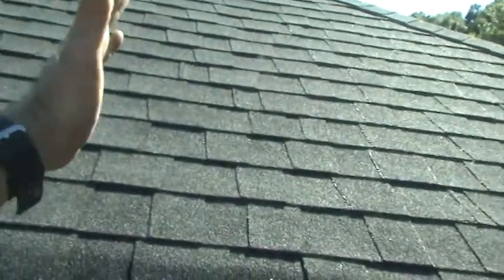All this water comes down in this corner. You got this upper section of roof drains to this gutter, which drains to that downspout, which backs water up this way, because all it's going is in that little area right there. And you can see what's happening. That's why I love this business, because it's so common sense. A plus B plus C equals rotted wood behind the downspout. So all that rotted wood, if it's not getting water at it, guess what? It's not gonna rot. It's just not. That thing's rotted all the way through. I can put my finger through it.